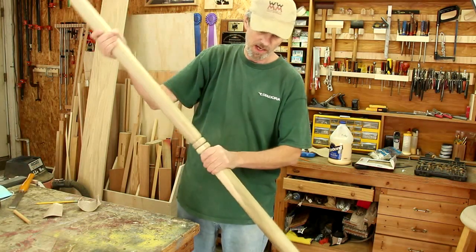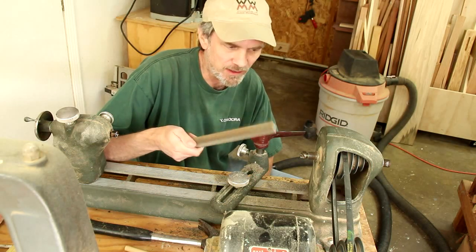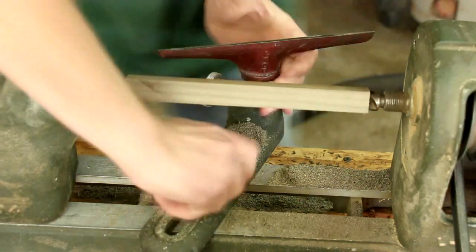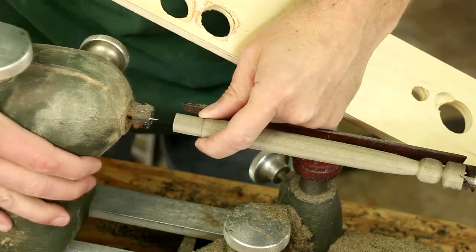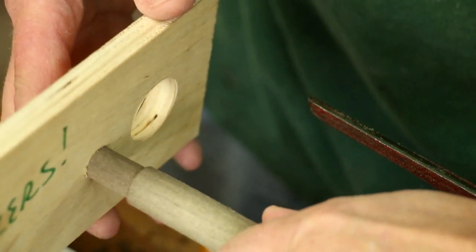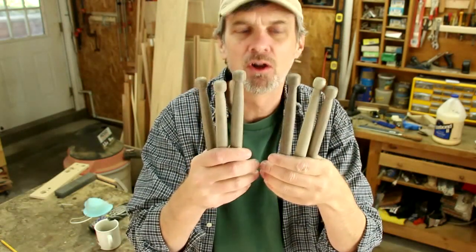I'm not going to glue this up yet — I've got to keep it apart while I work on the stand. Just when I thought I was done turning, I decided to turn the pegs. This will go a little bit quicker because I'm just using three-quarter inch lumber. I cut them into square pieces and I'll just bang them out. I'm making a little half-inch tenon on each one, and to test it I've made a board with some holes in it — that's the half-inch hole. I'll just keep testing and cut the top part off of each one. There's all six of my pegs, and they're all a little bit different from each other, which gives it that handcrafted look.